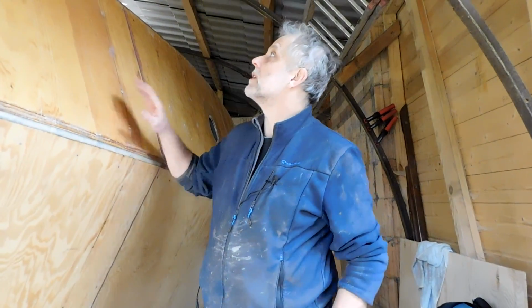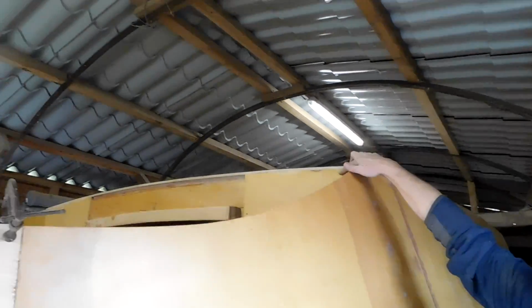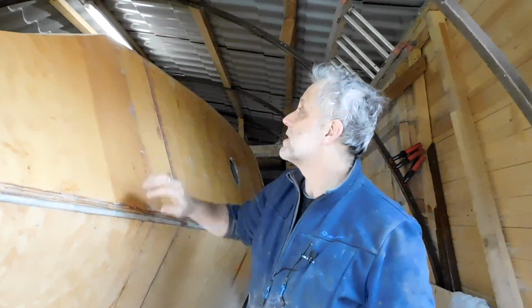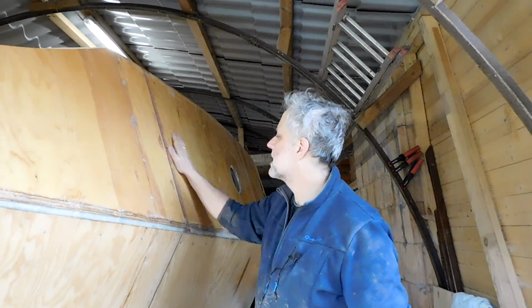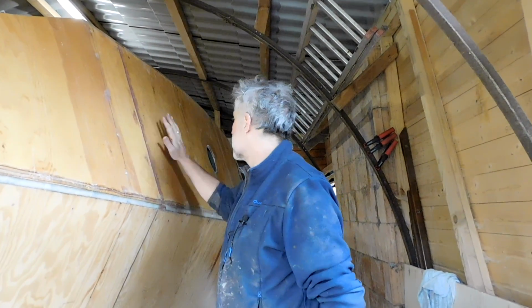Another thing I did was trim up the 4.5 on the raised deck along there. It was overhanging a little bit, and I just went along there, trimmed it up, planed it to the right length, and gave it a little bit of sand, because we're trying to get ready to get some glass on the main raised deck and these cabin sides. As soon as I think the weather's good enough, and at the moment it's not bad, hopefully it's going to stay like that. As soon as I think we're consistent, I shall get this glassed, the raised deck and the coach roof sides, which is one of the reasons, of course, why we're getting those bulwarks complete in preparation for that.